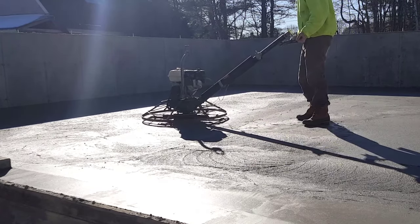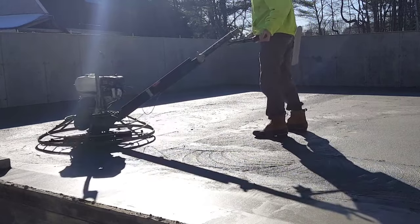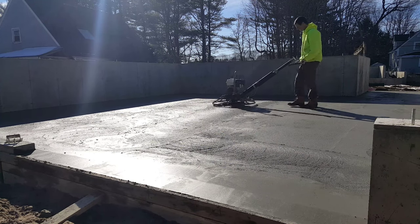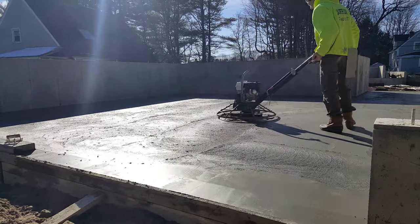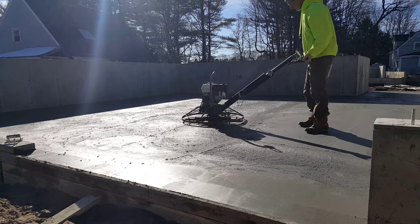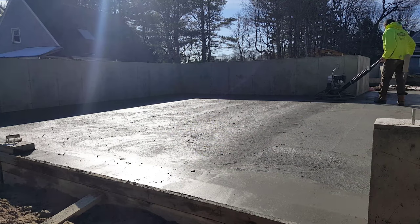This was about a 28 by 28 garage, nothing huge. We also did the house, which is down on the other side of that wall - that's where Darren and Luke are right now, finishing that. But I wanted to show you guys this was a good example of when you get on the concrete too early and what it looks like. If you continue to power trowel it when it's too early, you're going to create a bunch of dips and humps in your floor that are going to stay in it - you're not going to be able to get them out as it gets hard. That's pretty much what it should look like on the first pass - that's pretty darn good timing right there.